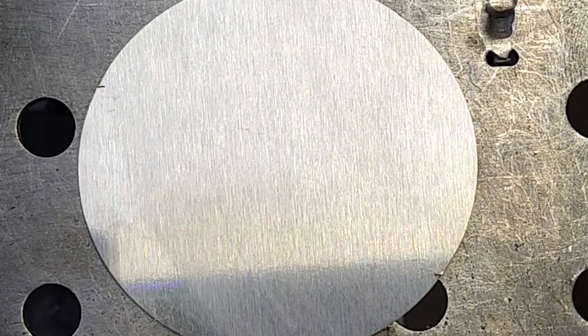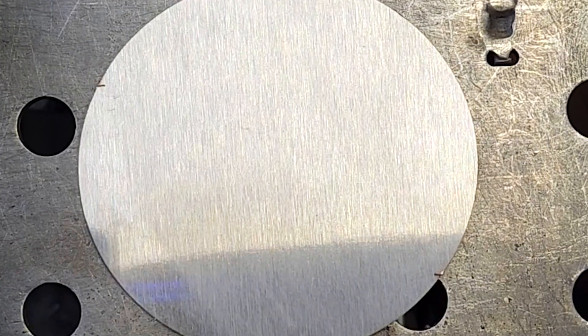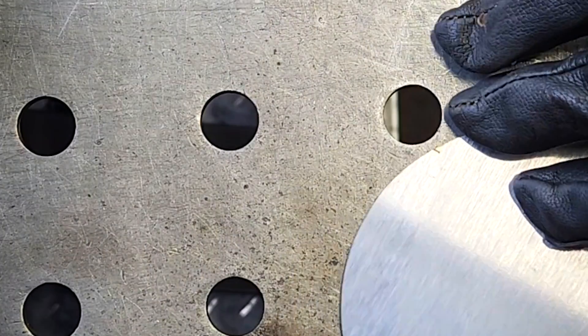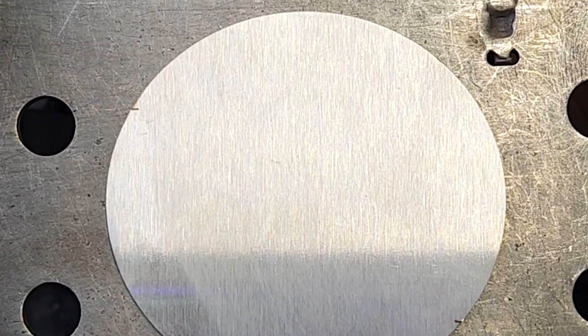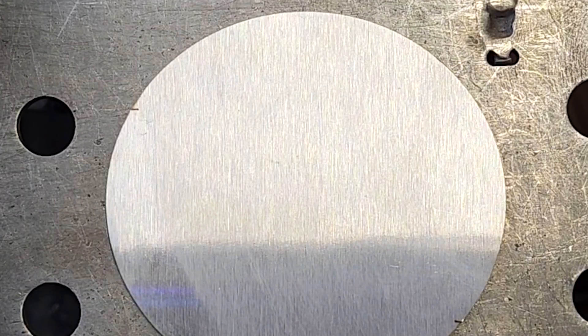I have that brushed piece here — just a drop from our laser. A lot of the time we'll be working with materials that are brushed or polished, and certain finishes are a lot easier to weld on because they're a lot cleaner and require less prep. I just wiped it down with some alcohol to remove any grime, and I'm going to run a quick padded bead over it. It is a sixteenth inch as opposed to some of our other materials today — typically when I drop down to thin material like this I use a sixteenth tungsten. I've welded things as thin as 19 thou using a 0.040 tungsten. It just depends on the application.